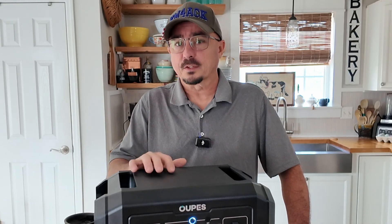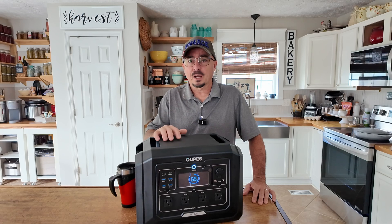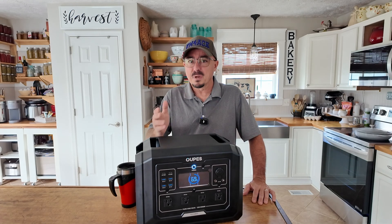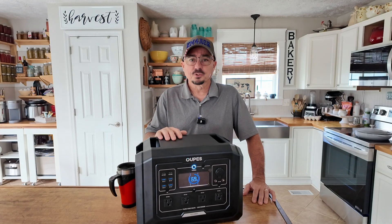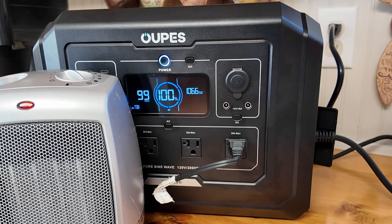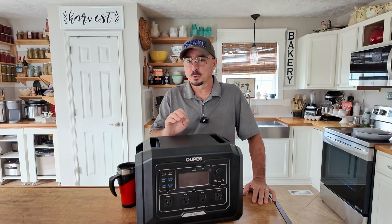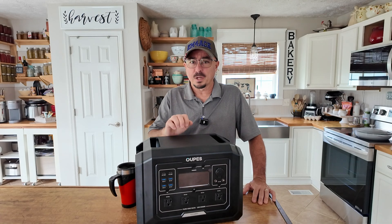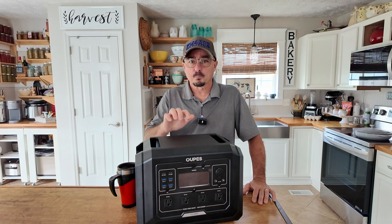This solar generator would be great for several use cases. Maybe you want to use it tailgating — this would be a great device to have with you. Maybe you want to use it as a backup power supply for home medical equipment, like a CPAP machine. I'm going to be using it in the RV and in the pickup truck during travel days. Another cool feature is it will work as a UPS, or uninterruptible power supply. The switchover time is roughly 20 milliseconds, so I might not trust it for a server, but for most appliances or radio gear, it would work perfectly.